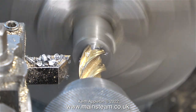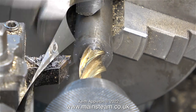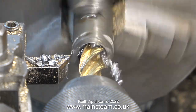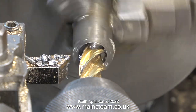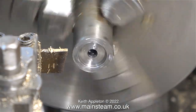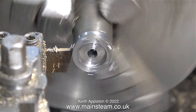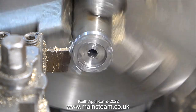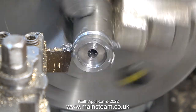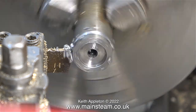In this clip I'm using an end mill in my tailstock chuck, and you can tell by the noise and vibration the lathe is going far too fast, so I slowed the lathe down using back gear and now it's cutting a lot better. The lubrication I'm using is WD40, which is not the best lubricant in the world, but it did the trick, and now I have a recess in the piece of steel. This sequence shows the parting off operation — I do speed the video up towards the end just to get through it in a reasonable time, because this is not a quick job.